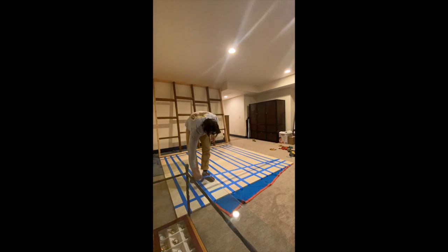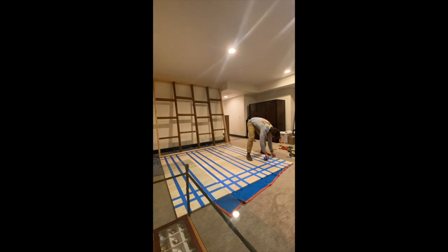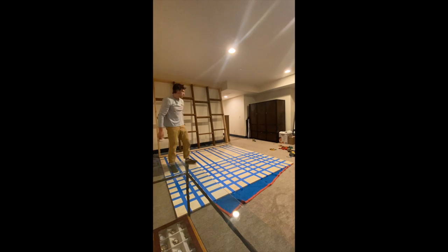So here I am taping out my T-nut bolt pattern grid. Each intersection of tape is where I would drill a hole for the T-nuts. And to elaborate on the importance of T-nuts, that is what allows you to rearrange the climbing holds. If you simply drilled the holds into the wood, then they would be stuck there, otherwise taking them out would leave a hole. So the T-nuts allow for that adjustability on your climbing wall to set new climbing routes and to move the holds around without damaging the wall further, since the T-nuts live in the wood permanently.